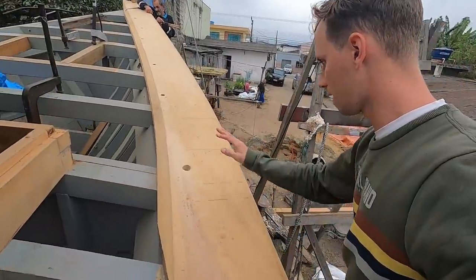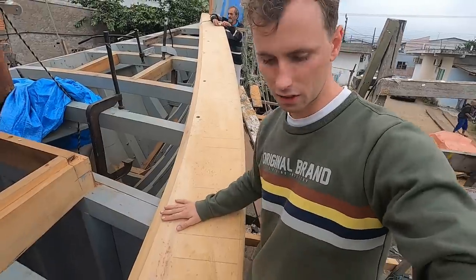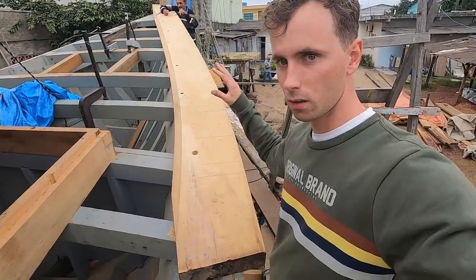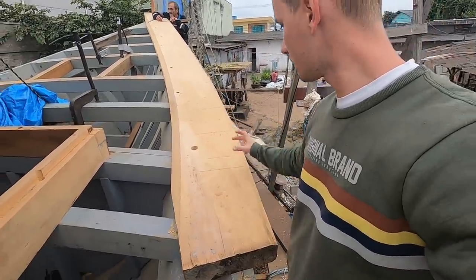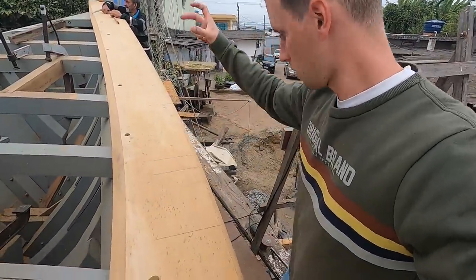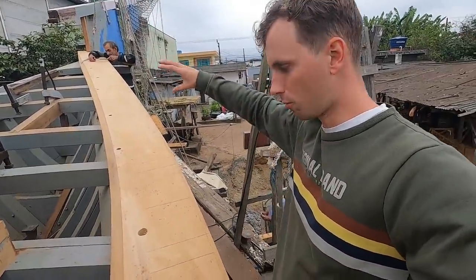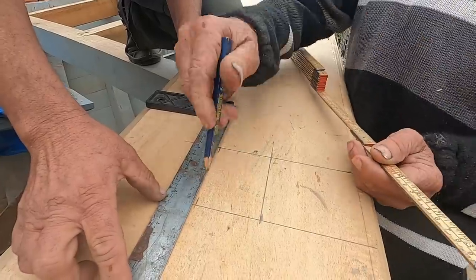But as you can see, they've been fastened onto every single beam over here with a 1/4-inch threaded bar, washers and nuts again, with some Sikaflex and some primer inside there as well. So what's happening right now is these cabezos are going to be like the columns coming up over here, holding the gunwale on, which is going to hold the rail, which is probably about this high, all along the boat.